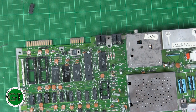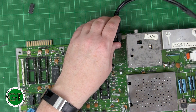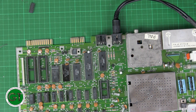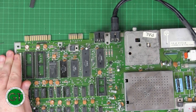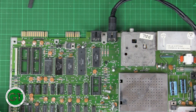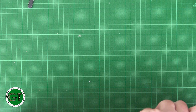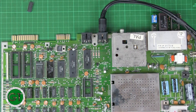Time to plug the power and video cable in and see if we have any more faulty memory chips. The memory count is showing 30,667, which is definitely not correct — it should be higher. So let's plug the Dead Test cartridge back in. The Dead Test now says U11 is bad, so we need to replace U11 as well. I'll do that off camera.